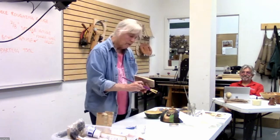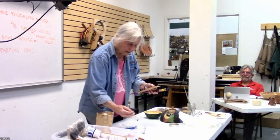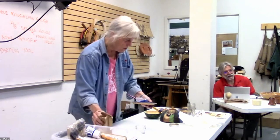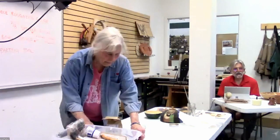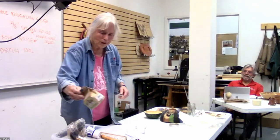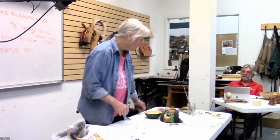So I think I've told you everything that I do know. I will clear out my little demo here. I'll take these to the sink. That's what you said about finish. My rule of thumb is oil based generally yellow, water based generally is somewhat transparent on the color. I've used oil based on it and it darkens it. I can't tell if it's yellow, but it does darken it up so that it looks like it's wet again, instead of when it dries, it gets that lighter color. Yeah, but there's a lot of room just for experimentation and play.